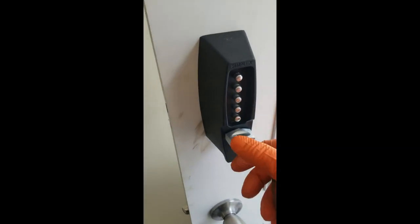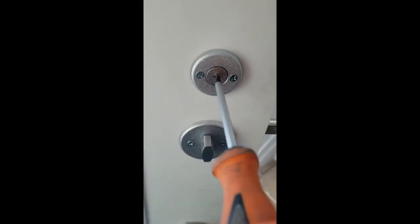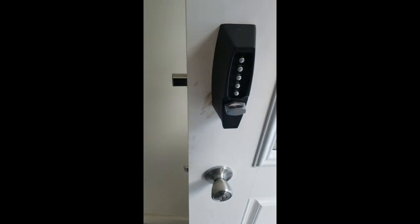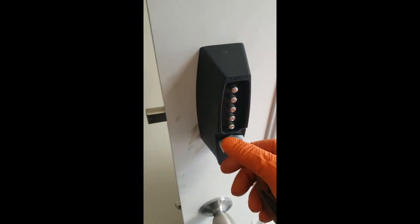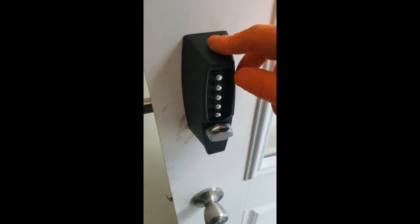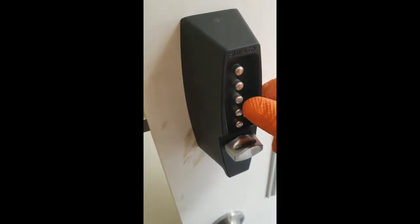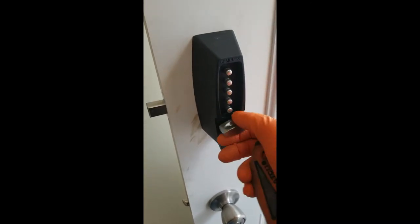What you want to do: you're going to lock the lock, come around to the back side, insert your screwdriver in the top — click. Come back around to the front of the door on the outside. You're going to turn it counterclockwise, which is lock again. Now just dial whatever combination you want to put in. Let's go back to two, four together, and three. Now you unlock it. Now your combination is set — it's two, four, and three.